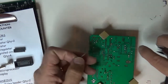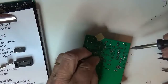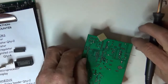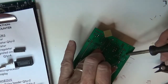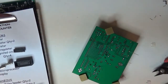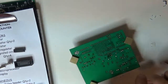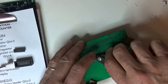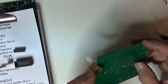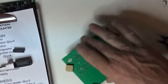Now in this case I was a little tippy because I took one of the legs off and moved around, didn't put it back on. So I'm holding it down with this finger over here so that it doesn't wiggle on me. I have a tripod base instead of a quad base. Missed that guy right there. Okay, everybody's soldered. As I'm cutting them off, I look at the solder joints just to make sure that that lead is indeed soldered. And here I'll put my fourth one back on. So now I'm back to a stable base.